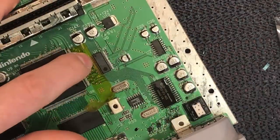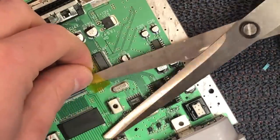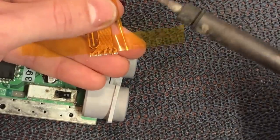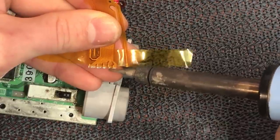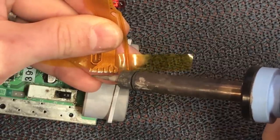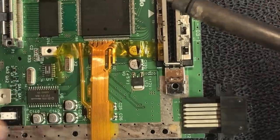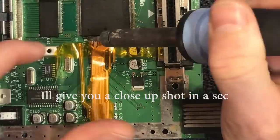So I've just put a bit of tape on the board, press that down, and then with some scissors just cut that off and tuck it down. In preparation for putting this on, I've actually just put a bit of Kapton tape across it and very gently tinned up the pins. With a little bit of solder tinned up on those pins, I now just go through each one with a fine tip soldering iron and try and complete the little pins. I've actually done the very first one and the very last one, so let's continue on.